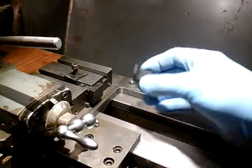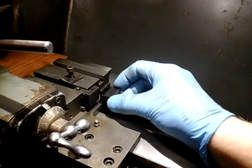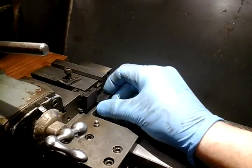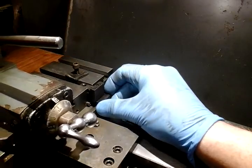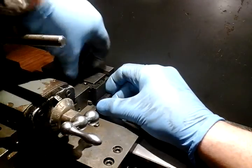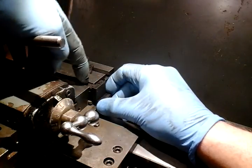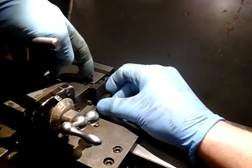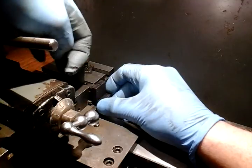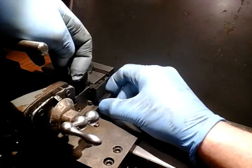The adapter part that fits to the tailstock bolts to the tailstock base and hooks onto the cross slide part. You bring your tailstock up to the cross slide, position it up, then slide your cross slide over like that and it catches hold of that lip. Then you put this clamp on top to clamp everything into the cross slide. There's nothing to stop you making a longer T-slot or some other method if you haven't got T-slots.